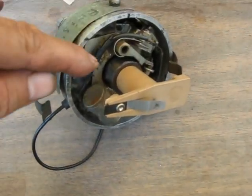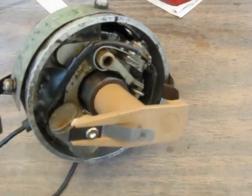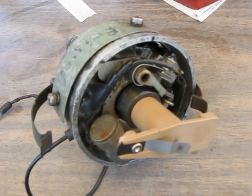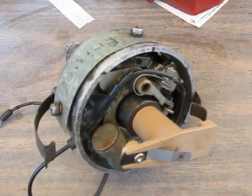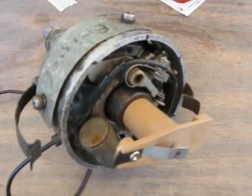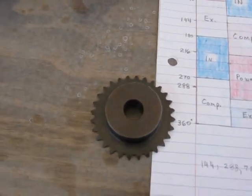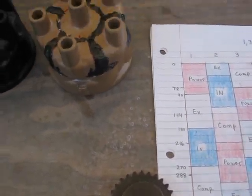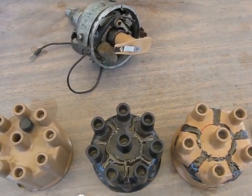I'll just need to make the points opening cam. My son is going to try to machine some of those out of plastic. Hopefully that'll work okay — the engines don't run long so I don't think there's that much force opening the points that plastic won't work. At the same time I'm increasing the size of the distributor drive gear to mount the distributor on the other side of the engine, to get the spark plug wires away from the hot exhaust.